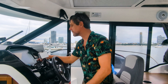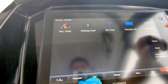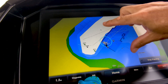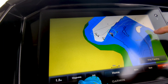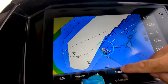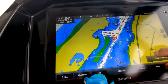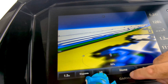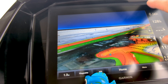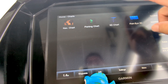I've got two cameras going so hopefully you can see my fingers — it's just an introduction to how the chartplotter works. You've got quite a few different options. In the charts you have the nav chart, which is your normal nav chart. You can pinch and zoom like your phone, or use the buttons to zoom in and out, and if you've moved it around too much there's a stop panning which will bring you back to your location. There is a fishing chart which I'll show you underway. The 3D chart is also more for when we're underway — it shows you all the terrain, though it's quite a difficult one to use. It does show you the beacons very well, which is handy if you're travelling at night, but I don't really prefer that one.